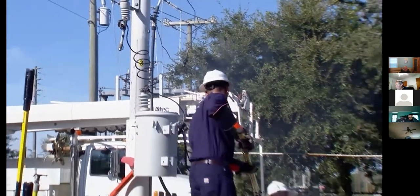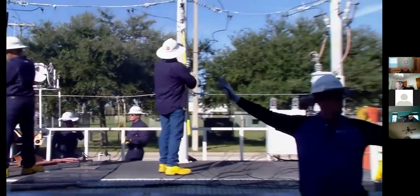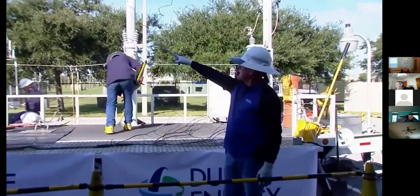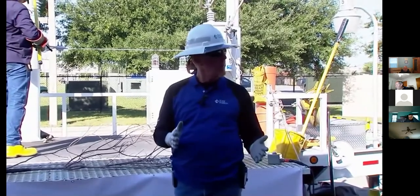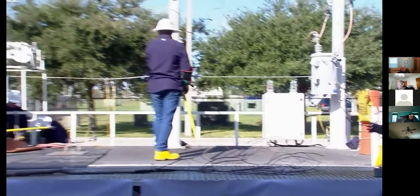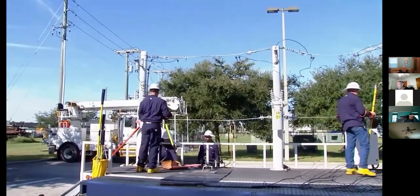Now anybody who comes running down the street saying 'Hey, that transformer just blew down there' — well, typically it's not a transformer. If you look and see that arm he's going to take down, it's actually a fuse holder. Ninety-nine percent of the time it is a fuse that blew, instead of the actual transformer itself.